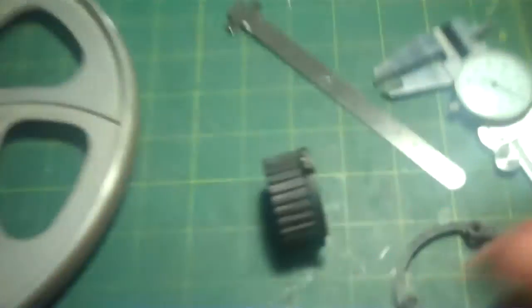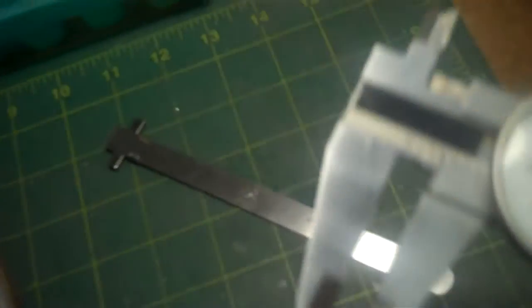So I have to add an extra on here. When I took a measurement here, from here to here, for the height of the feet, I found it to be roughly around 220 thou or something like that. I'll have to check that again. So what I need to do is add that onto what I have here now to accommodate for that. I'll show what I mean.